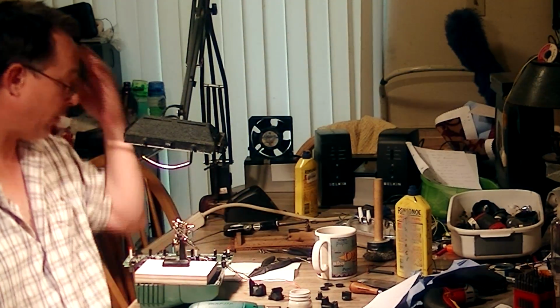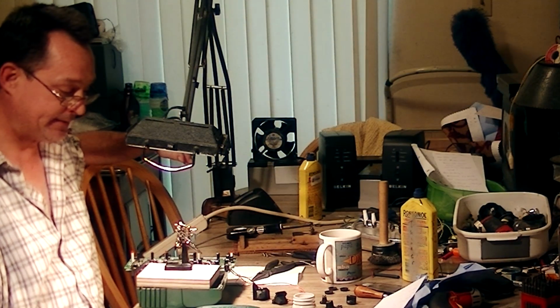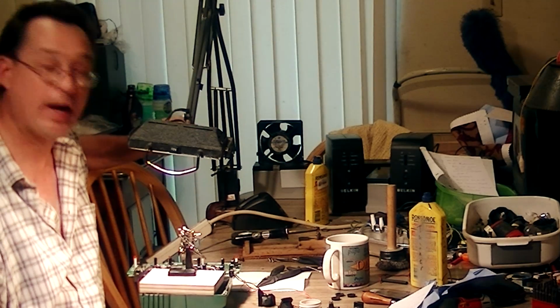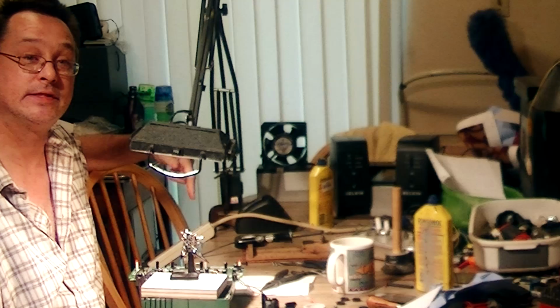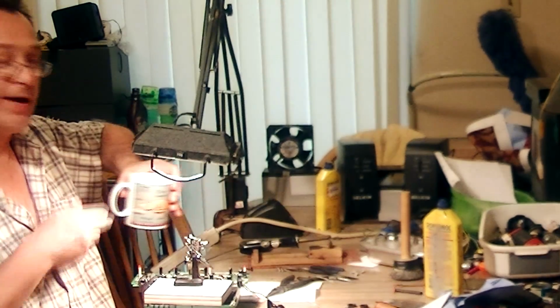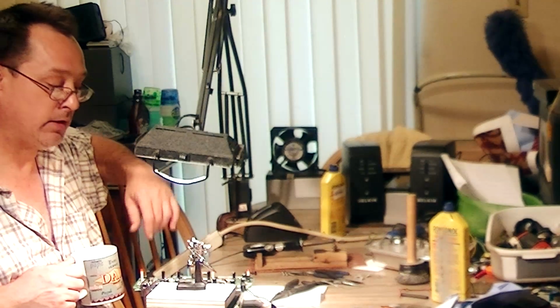So that's about it. SMD stuff, it's a fact of life, and I know that it's scary to work with. But I would encourage you, if you're going to attempt something like this, go through your shed, go through your storage area where you keep your junk, find an old modem or something that's SMD and practice removing the components.